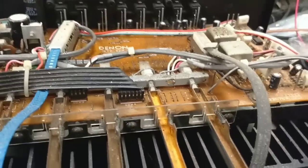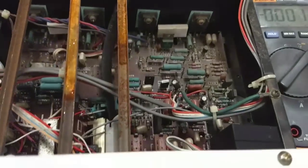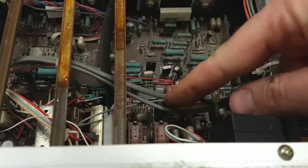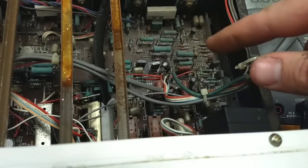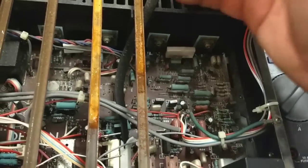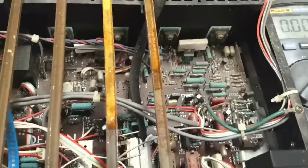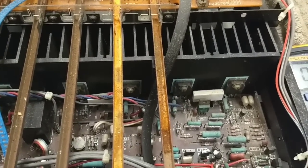So now we have to look and see if the signal is distorted before it gets to the amp or after the amp initial stages. You've got these FET input devices here, which then fire into this Class A thing. And then you've got your AB drivers down here and your finals. It's hard to tell if they're running it as a bridged amplifier or if they're just staggering the components for some reason or if they've got some weird configuration.